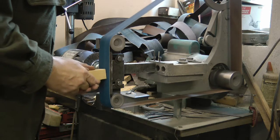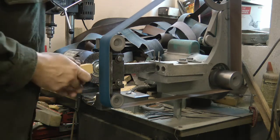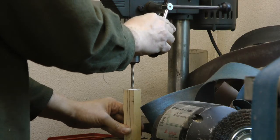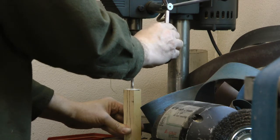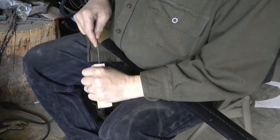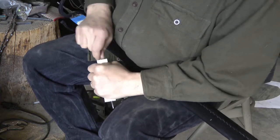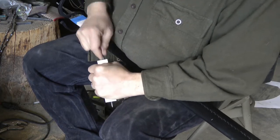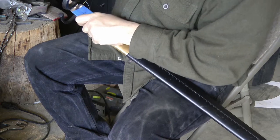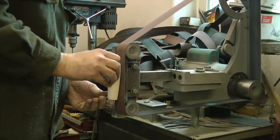Next we've got shaping a piece of maple for the handle and drilling it out. Maple is absolutely my favorite wood for just about any knife handle — it may not be the fanciest looking, but it really does a good job. I continue using a small file to try to fit it to the tang of the sword — you can see the sword across my lap.